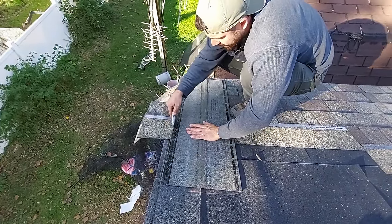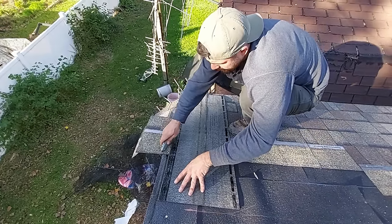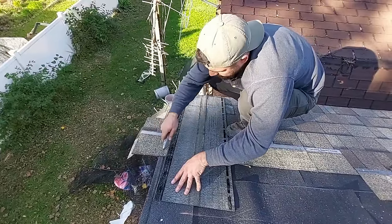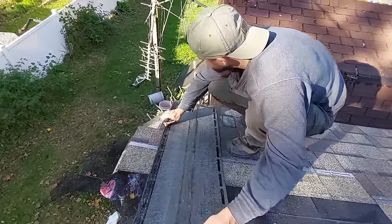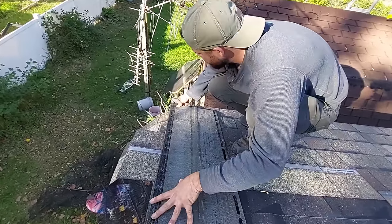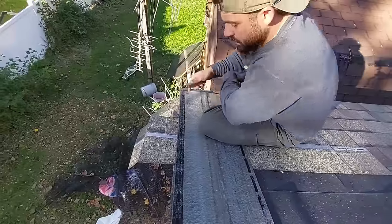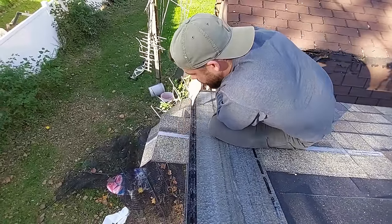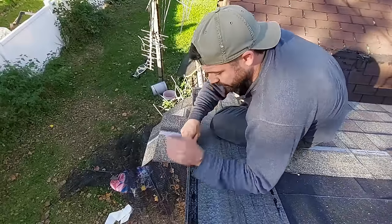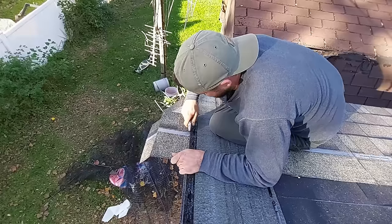I prefer to use the thin side here, but there is still another perk to putting it upside down, and that's when you slip off of this cut, it's harder to cut into this edge than it is this. This is more grippy. For some reason, it doesn't grip as much when it's upside down. So what I do is, I'll stay just about an eighth inch away from the edge. Okay, get some weight on this thing, get comfortable, and you want to be looking at it so that you're cutting sideways across, like across your face underneath it. Alright? So we're gonna hold some pressure here to lift it up, that way we don't cut through the starter. We're gonna cut right along that edge.